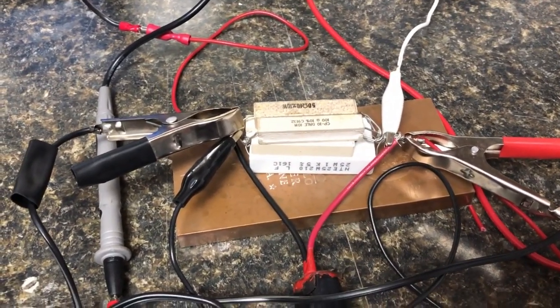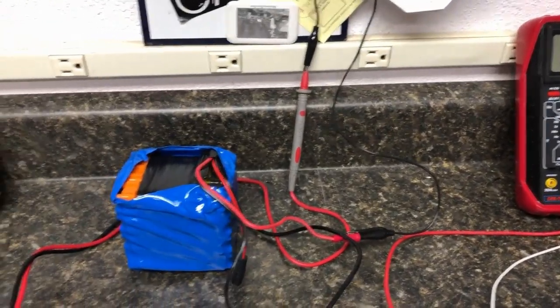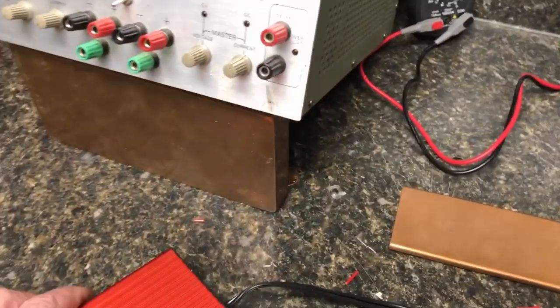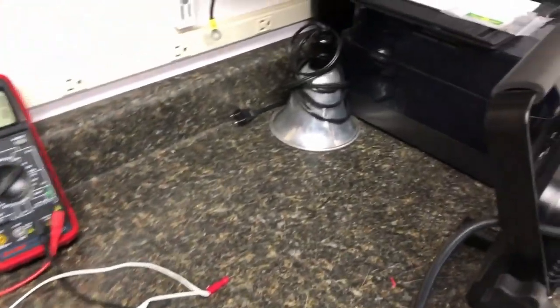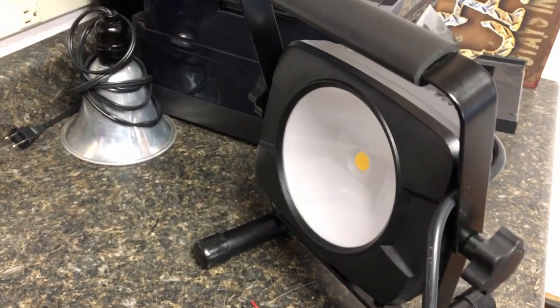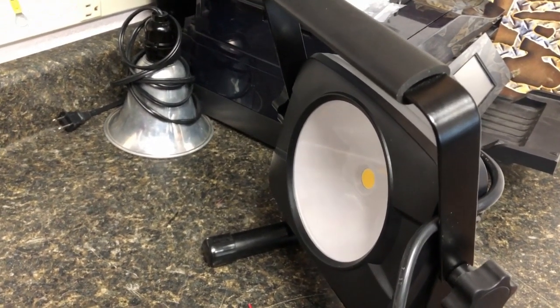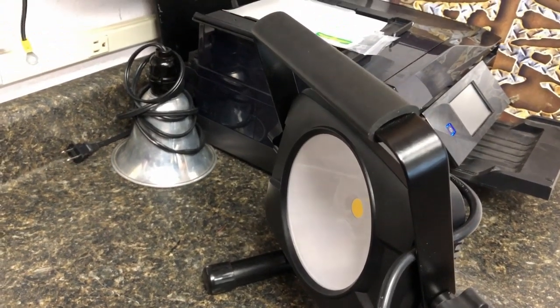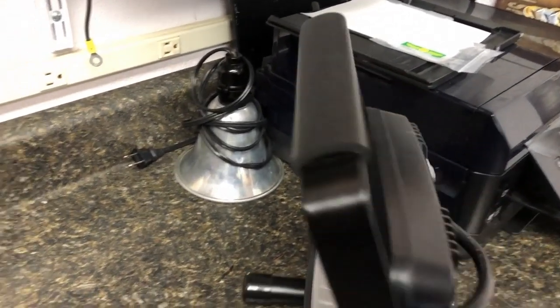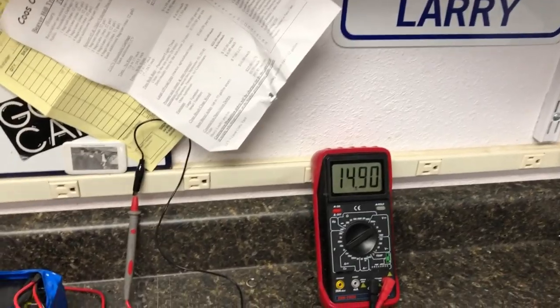these resistors for a while, but now after the battery's down to just under 15 volts, I've added an inverter with a regular Ace Hardware LED spotlight, which consumes 3.5 amps and operates at approximately 34 watts, and it gives you some really bright light. So I'm going to attempt to turn that on and look at the current and the voltage when I turn